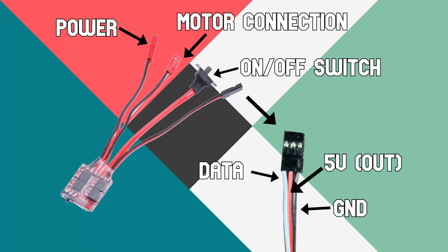In the middle is the 5-volt pin. However, instead of taking 5 volts from the Arduino, this ESC has something called a BEC integrated in it, which is a battery eliminator circuit. This makes it so that you don't need a separate battery to power the Arduino and the ESC. The middle 5-volt pin is connected to the Arduino's VIN pin and powers the Arduino, so that you only need one battery to power the ESC, the motor, and the Arduino at the same time.